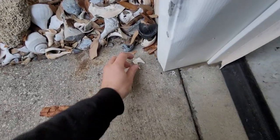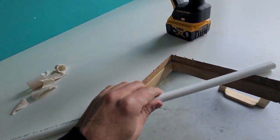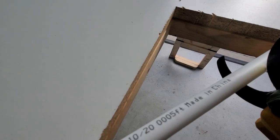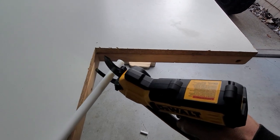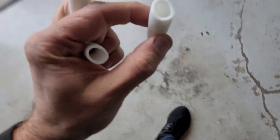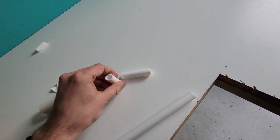It is pretty chilly out today here in Wilmington — probably around 38 to 40 degrees — so the PVC didn't do well in a cold test. Now PEX is a friendly relative of PVC, a very similar plastic but actually a little more rubbery. For those plumbers out there — that did a nice little chop. It does crush a little tiny bit and you can see some oblong rounding, but it gets the job done pretty quickly. So PEX is actually great.